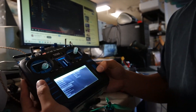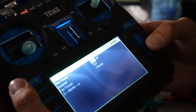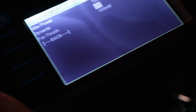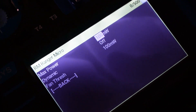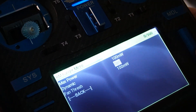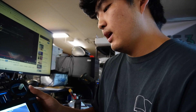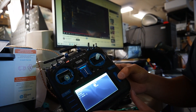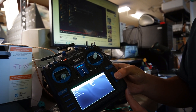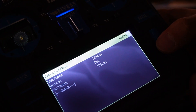How do you set up dynamic power? This is one of my favorite things. Back in the day I would just run 100 milliwatts with no dynamic power — 100 milliwatts all the time. Once you turn dynamic power on, you have variable output power based on your RSSI and link quality. It will go from a minimum of about 25 milliwatts all the way up to the maximum power you set, which on my module goes up to 1000 milliwatts.